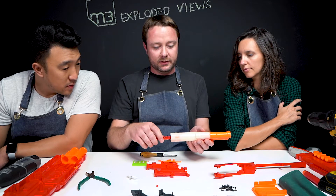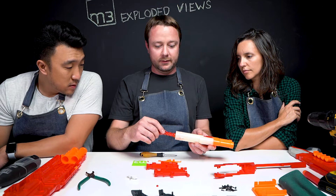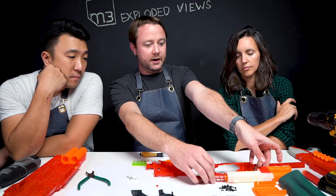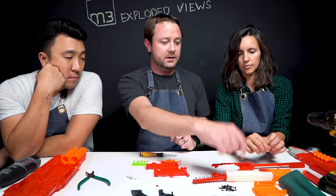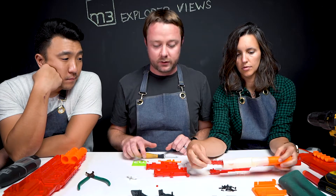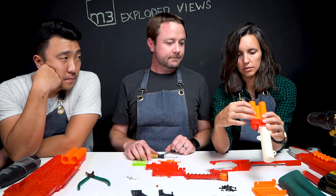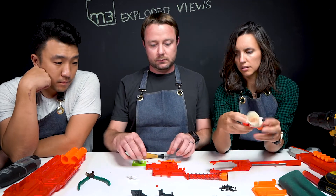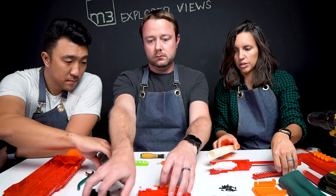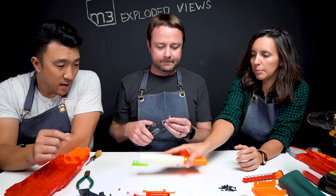It's a decent sized cylinder too — there's a lot of air in there. Pressure is force over area, so you need more force because you've got a bigger cylinder cross-sectional area. What about the design of the mechanism that senses what dart is in what chamber? We've got to do some plastic surgery, cut it apart.